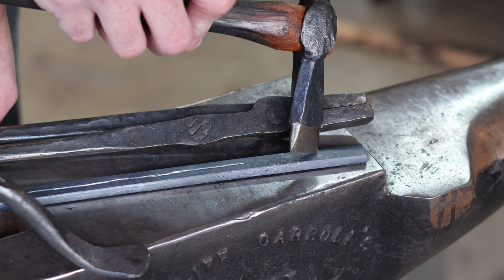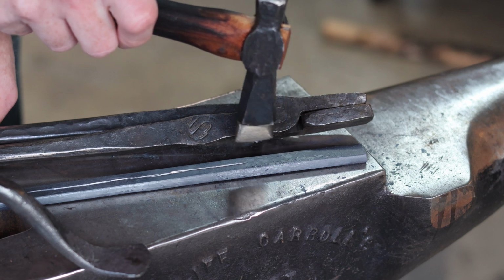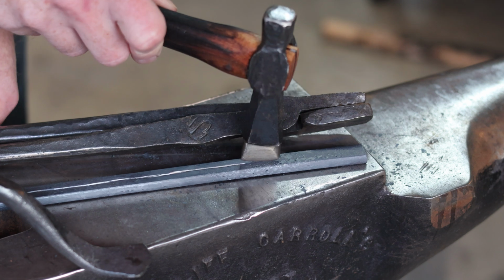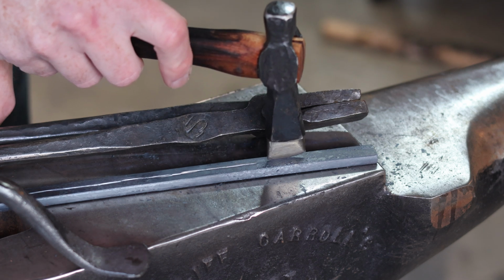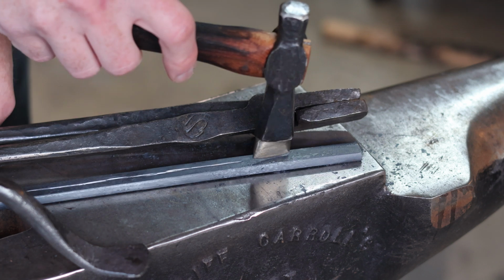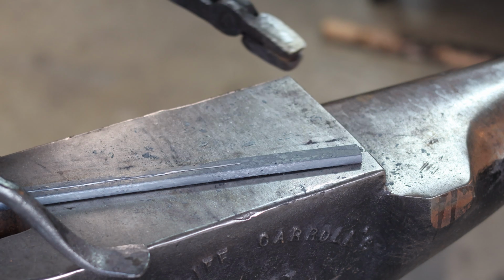Now I'm going to make this chisel cut about 1.5 inches from the end, and then I want to make sure that the boss is roughly square, maybe a little oblong. It's okay if it ends up a little oblong, but the biggest thing here is to obviously not cut the center mark all the way into where your boss is going to be. So I'm going to go ahead and lay those out now just below a black heat so that I can see where I'm measuring and where I want all these cuts to be.